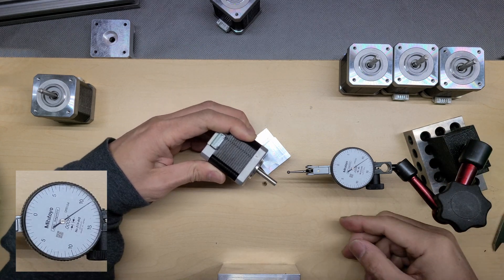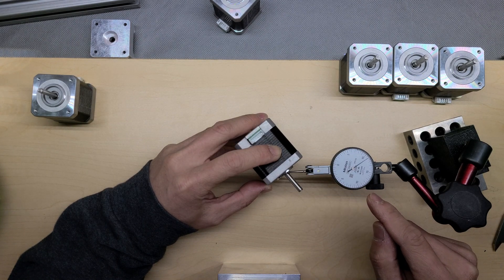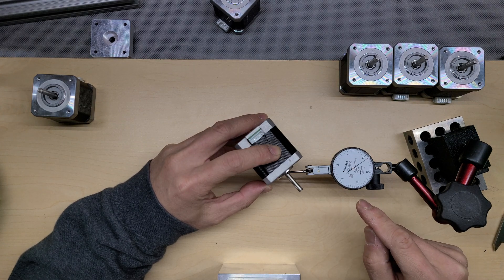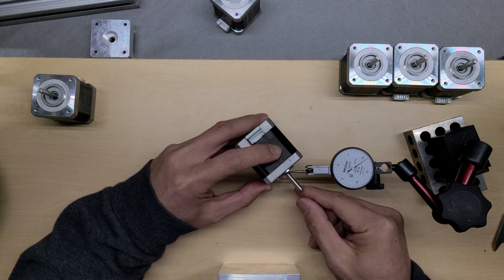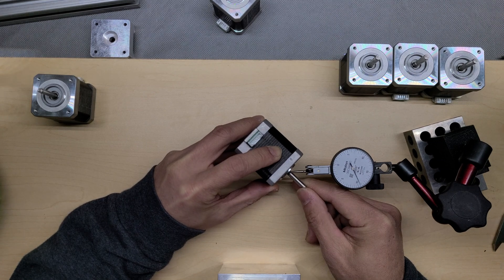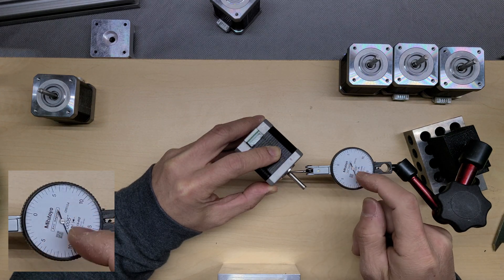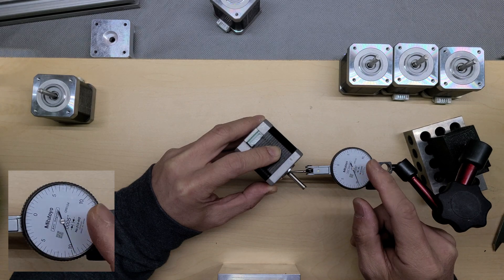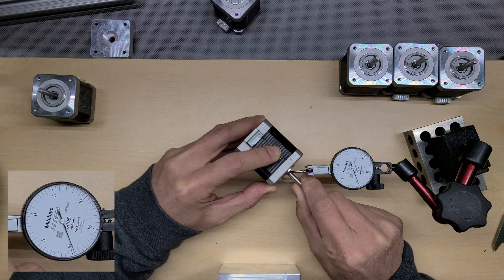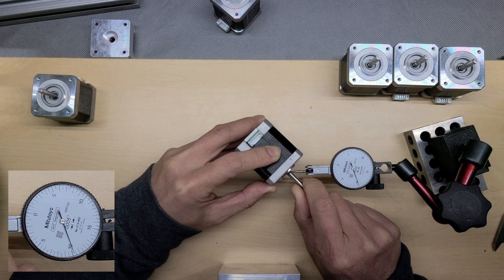At the end of this video I'm going to show you the bad ones I purchased. I use this dial test indicator a lot on my 3D printer to check for flatness of my bed. If you have money, invest in one of these dial test indicators. You can get a Chinese-made one — no problem. I'll put a link to one on AliExpress. When you purchase a dial test indicator from China, don't put any magnets near the face because the gears inside are magnetized and the needle can be damaged.